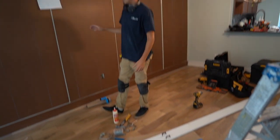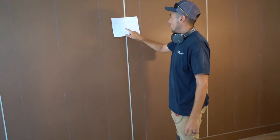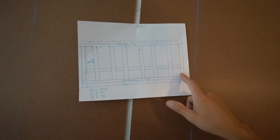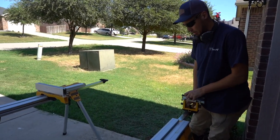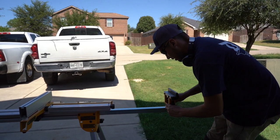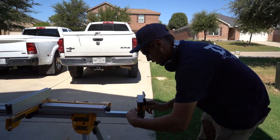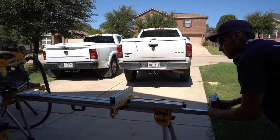We can get working on the rest of our material cut list. We have our top rail drying with pinch dogs and screws, same thing with the bottom rail. We need to get those side stiles — eight of them at 90 and a quarter. We're going to set a stop block on the saw and cut all eight. It's really pathetic that I'm still using these original DeWalt stop blocks — they're not that great but I make them work. I did order a new saw stand with a really nice stop block feature, so I'm waiting on that to come in.